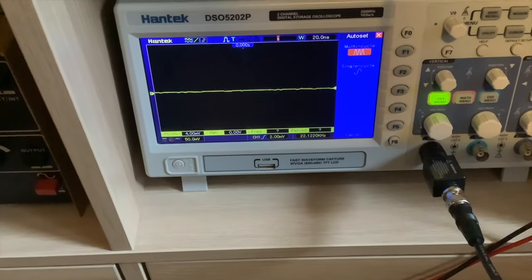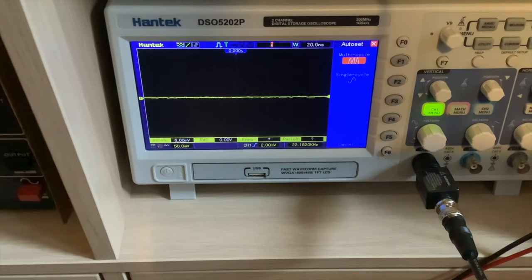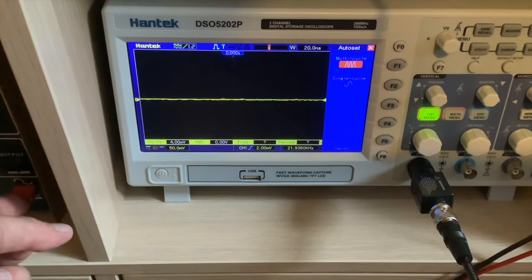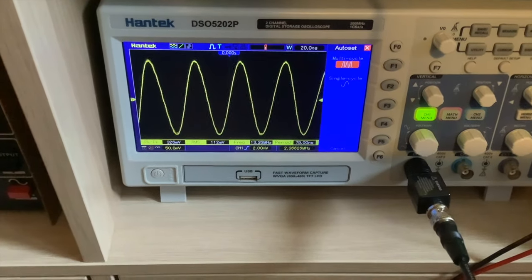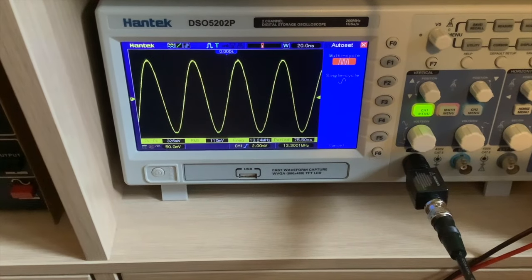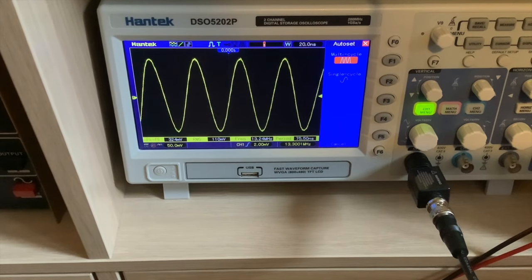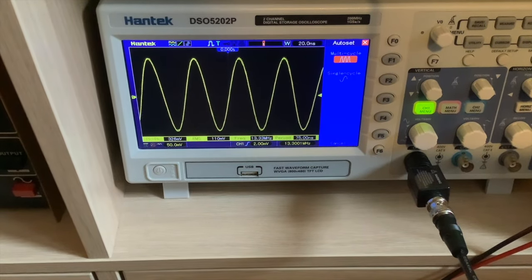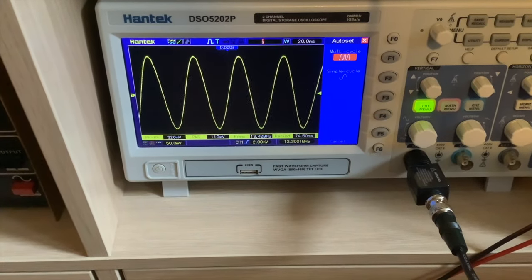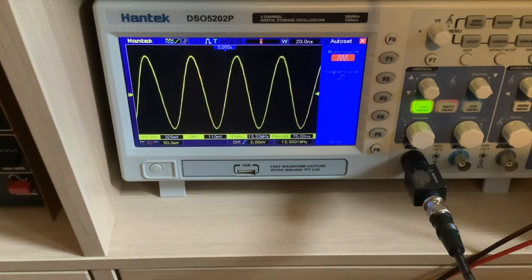Starting with the left-hand (transmit) power - hopefully nothing appears - brilliant, correct! Switching on the right-hand side (receive) - fantastic! And as you'll see, we've got a stronger signal there because it's a stronger amplifier - about 21 dB going through that bottom amplifier. The bi-directional switching works very well. Thank you Wes and Bob!